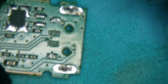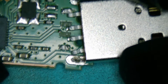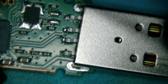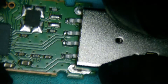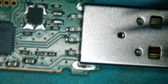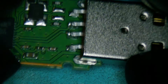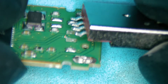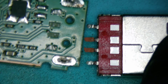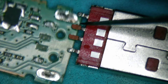So in a perfect world, if this was broken — depending on how it was broken — this is usually how it does connect here. You see there are four pads, and these two are actually broken off. Now in a perfect situation, the best situation usually is there is a problem mainly just with the connection here, that the pads don't get ripped. We don't know if it's been ripped because of the actual damage in the first place. Maybe this got chopped while it was in, maybe it got dropped while it was plugged in, something like that. We have the board here — see these two in the middle? This is actually part of the board here.